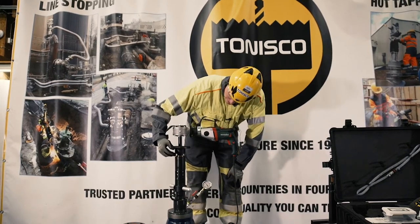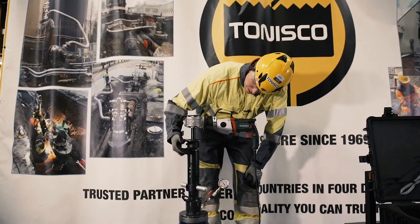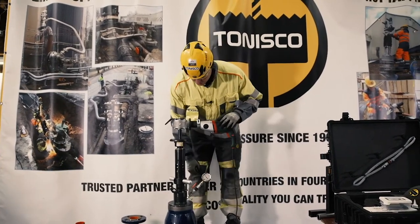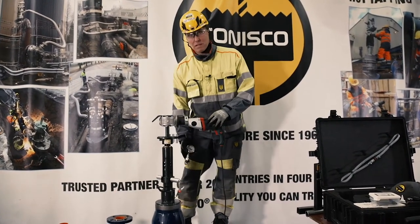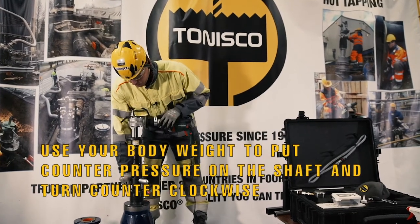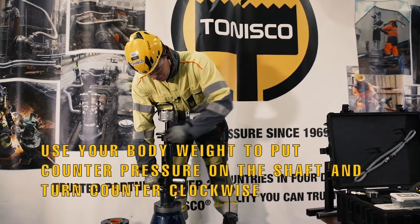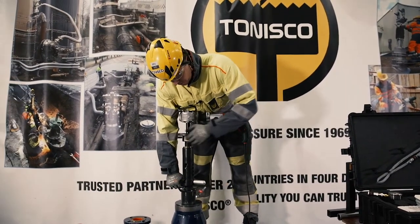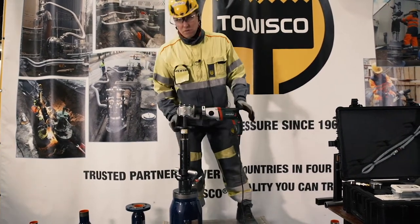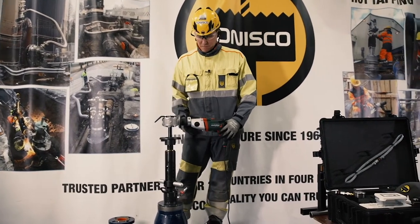Take a little bit back and check the feed distance remaining. It's just on the edge of not being enough, so adjust the feed socket for the hole saw drilling. It's also good to remove the manometer now, because we already know the pilot drill has penetrated and we've verified the pressure inside the drilling chamber. To adjust the feed, put your body weight on the handles, release the socket by turning counterclockwise, keep pushing and turning until the socket finds the next notch, then tighten it again. Now we have enough drilling distance and are ready to start the hole saw drilling.